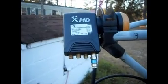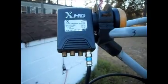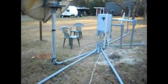I was going to build the system just using four, and then I decided to go with eight. So all of these are going to get replaced with eight-port LNBs. This elbow will come up, the pipe will come up here, and I'll probably put a weather cap — or weather entrance cap, they call them — it's almost 90 degrees and your cables can go in there and go down. These pipes, like I say, will all be buried. Got a lot of digging to do.